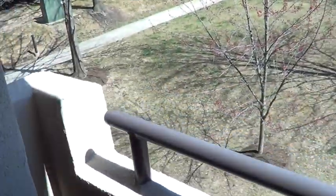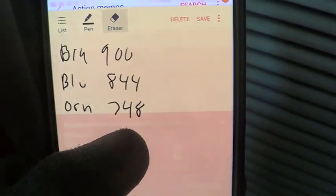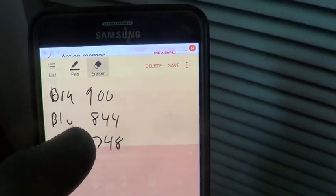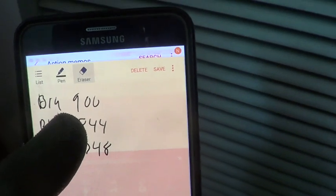Oh, here's the outside of the unit there. Nice new grill. So I measured airflow on the different fan speeds. From the factory, orange wire, it's 748 CFM for 2 tons. It really needs to be 400 CFM per ton. So the blue wire is closer to where we need, and then the black, which is high speed, is 900 CFM, which would be 450 per ton.